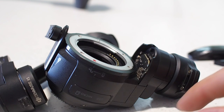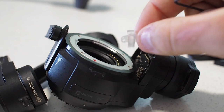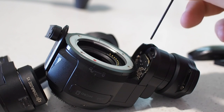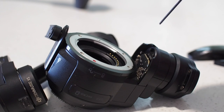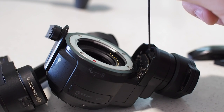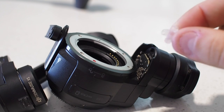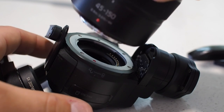Once you're inside there's this little piece of plastic and it acts as a fiber optic duct, basically just to bring the light from this little LED down here forward to the front surface so you can see it better. It's held on by two little Phillips head screws and if you remove them the little bit of clear plastic comes out as well, and effectively we gain about two or three millimeters — plenty enough to get the lens to mount.